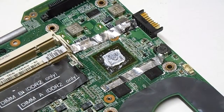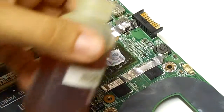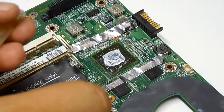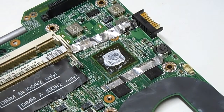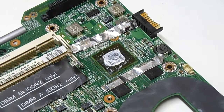Before we begin, just to make sure that the solder doesn't flow together, we use a flux. You can take the tip and inject it along the edges, along the perimeter of the chip. That way when the solder does melt, hopefully it doesn't stick together and you end up fixing it instead of making things worse.